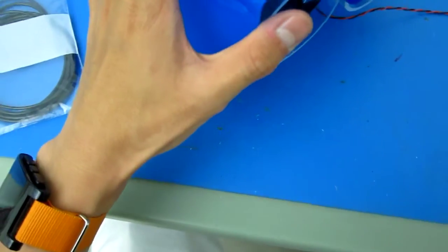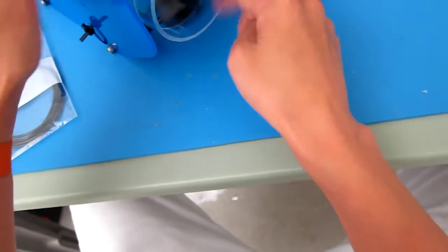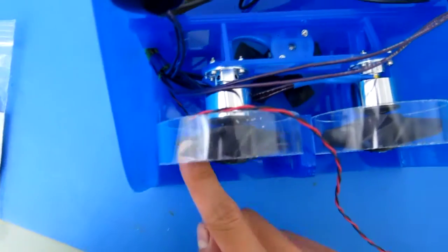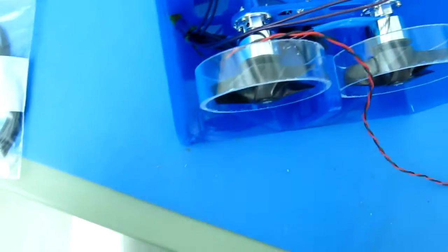So now we know that all the motors are pretty happy, and that you have your tube assembled. Okay. So again, this is just a check. What you also want to do is take this entire thing and flip it over really quick. Flip it all upside down. You have a fair amount of wires and cabling running over in the back. If you notice, when the motor runs, you have these wires loose and hanging around that might actually get stuck in the propeller itself, especially the tether wire. It's coming off the back, it's all loose and whatnot.